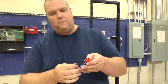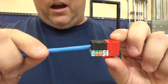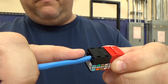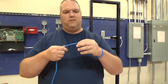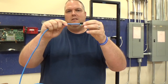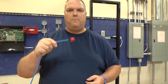Now when you're done, take the dust cover and cover the connection. When you're looking at this with a dust cover on, this is a completed job — this is ready to get snapped into a plate and almost ready to be used. I don't see wire sticking out here at all, because it's inside the jack connection. I don't want wire sticking out anymore because that makes this more flimsy. This is tight because it's basically a piece of cable. When I press these down, the wire is going to stay in place. I snap it into the jack, plug my patch cord in, run my test, unplug my tester, plug in a computer, a phone, whatever it may be, and it's all set.